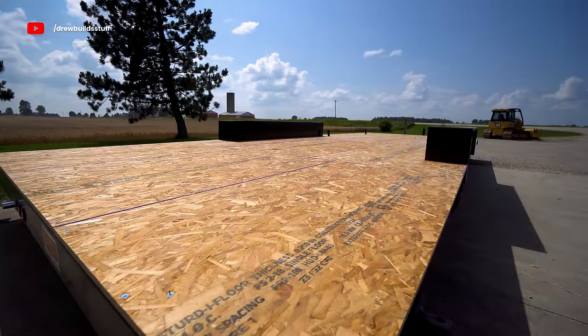So I'm just cutting a scrap piece of wood with that same 33.5 degree angle. And then measuring it to the size I want it to be, which is 5.5 inches. Then after I make sure that's sitting level, I can screw and nail that into place with some impeccable form.